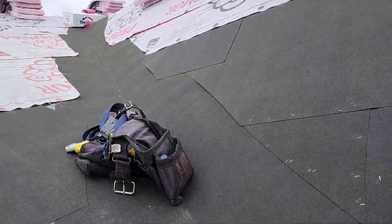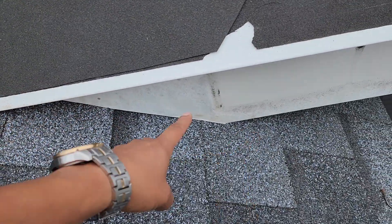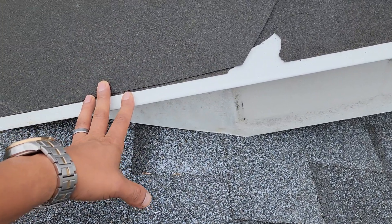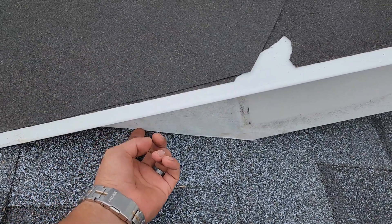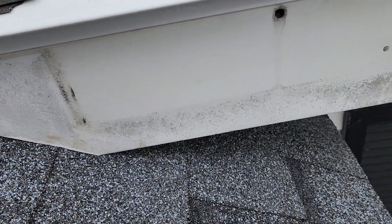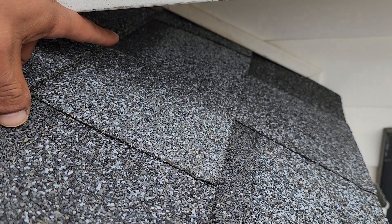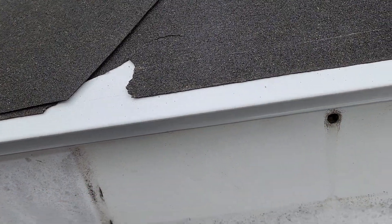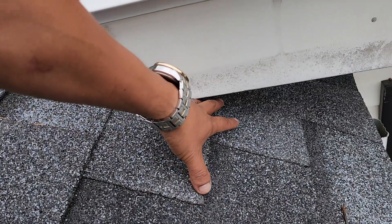We have a small portion of roof from the valley down. Normally what contractors do — because they don't want to do a little more work — is they just put the step flashing right in here behind the fascia, when this roof actually goes all the way in at least another six to ten inches more. So the flashing ends up all the way back there.